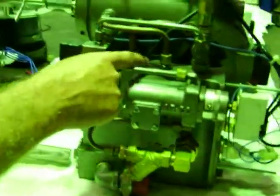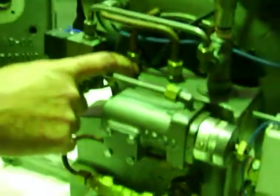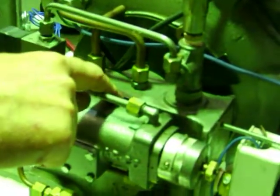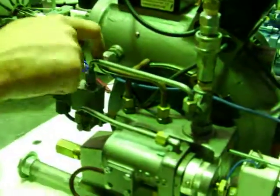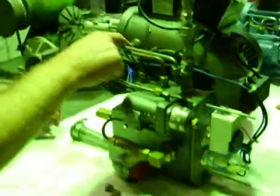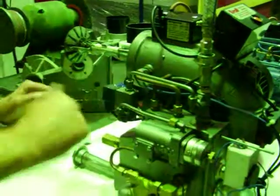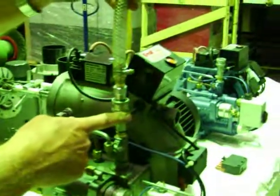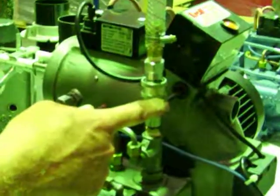The air gets sucked into the oil-air mixing chamber, which is built into the preheat tank — that's the air input. Once oil and air have been mixed together and compressed slightly by the internal compressor, the oil goes out to the nozzle via the oil pipeline. That output has mist in it — oil and air mixed, slightly compressed into a nice vapour — and that squirts out to the nozzle and gets ignited. Another major item here is the degassing pipe. So we'll continue on our chat next time. Bye for now.